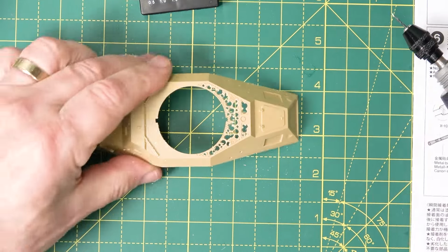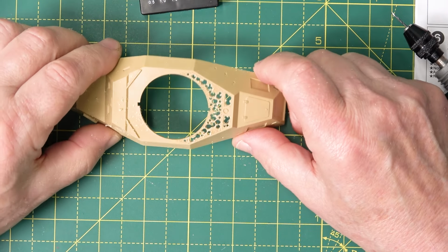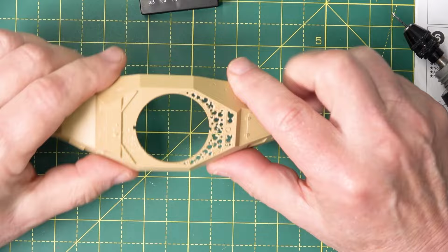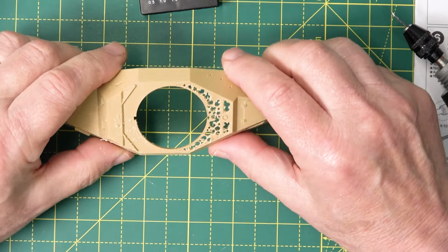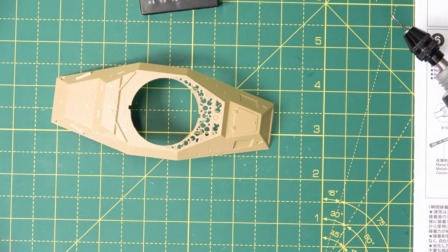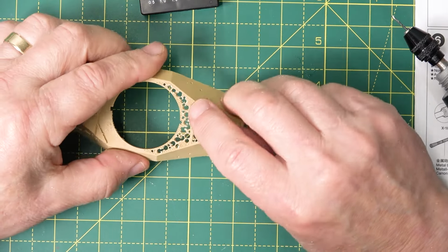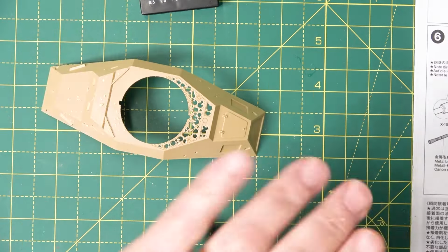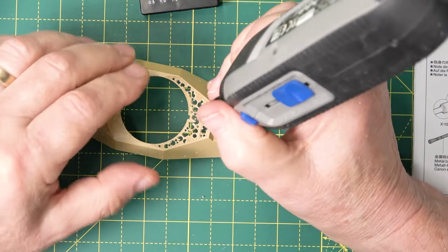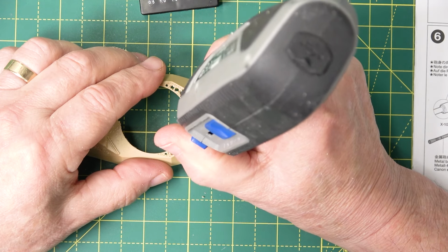Right, so we've got quite a bit cut out, and now it's going to be going in with a pair of snippers, and then using a grinding tool on a very slow speed because I don't want to melt the plastic. So I've got to go very careful and get round here. I don't know if I can go any closer to one part there, because I've got to leave these squares because they get covered over anyway. Just see, might have to get the hoover out again, but might be able to do a little bit more.